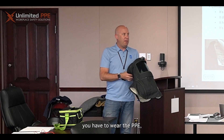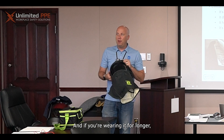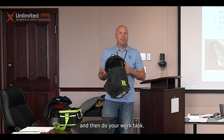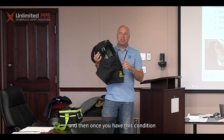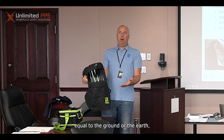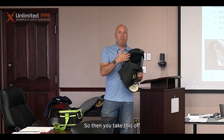The actual time you have to wear the PPE is probably less than a couple of minutes. And if you're wearing it for longer, you probably shouldn't be — you should turn the power off and then do your work task. You verify absence of voltage; that's part of the steps Chris described. And then once you have a condition that is considered safe — equal to ground or earth — you no longer need your PPE. So you take it off and work comfortably.